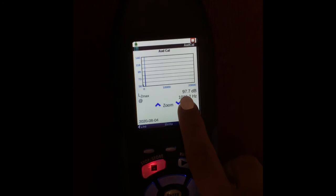And lastly, this was the test that I did at 95 dB HLs at 1000 Hz. The SLM read 97.7 dBs and 1015.2 Hz.